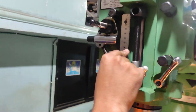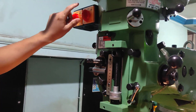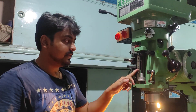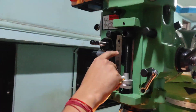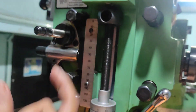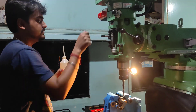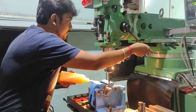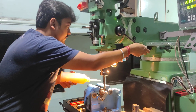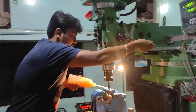This is the taper drill. I will start again. We have to bring it up to 74mm, so this is the reading scale and we have to pull the lever up to 74. Let's get started — forward to low speed. This scale is used to set the desired depth: for example, if you want a depth of 5mm, you bring the scale from 0 to 5. I will take the coolant and continuously spray it over the job because it gets heated.